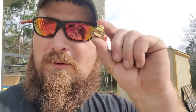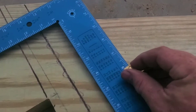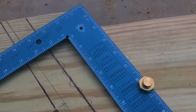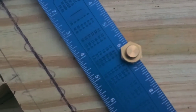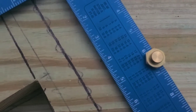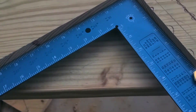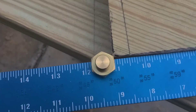Another really cool tool — super cheap, about seven bucks. Let me show you how they work. You clamp these little guys onto the square at the measurements you need. You also have to accommodate the thickness of whatever your tread material is gonna be. I've got it set right at around six inches and right at about eleven inches — so six plus the tread equals seven, and eleven for the run.